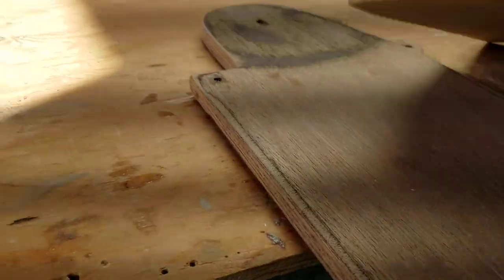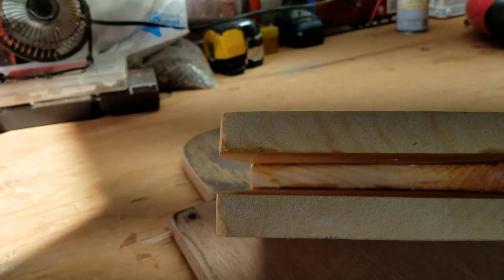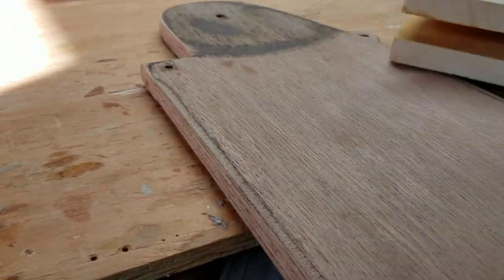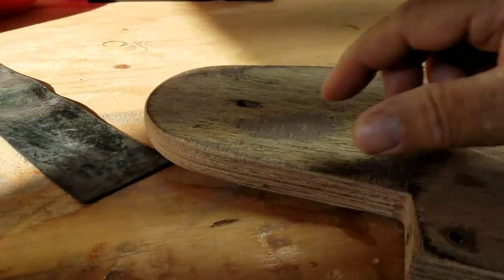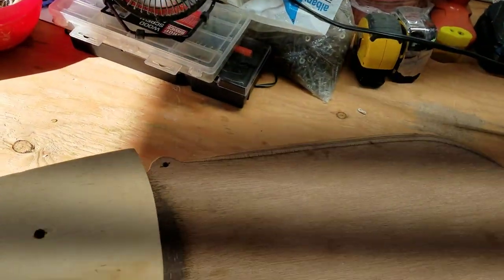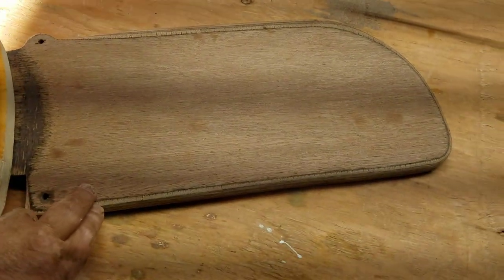Looking inside, this is three pieces of wood — the inside piece is rounded. When you glue them together, be sure to coat the inside with resin so it won't rot. Since the pieces were almost exactly the same size, I sanded it down a little so it would move better. Before gluing I put a hole here and here and ran a pencil through to make sure it would go together well. The reason I didn't use this one is that three pieces of plywood was just too heavy for the boat, so I made another one with two sheets of plywood and made it a little shorter — which is how I came out with the one on the canoe.